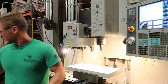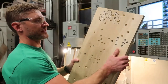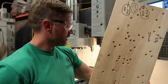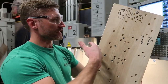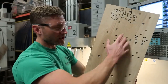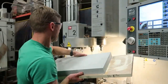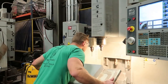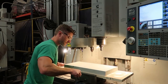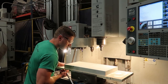On the back of this fixture board you can see I've got coordinates written down. These coordinates represent my G54, which is the part position in this machine — the machine knows where the center of all the machining coordinates are. This fixture does all three sizes of warbells: the 35, the 55, and the 75. That's why I need to write the coordinates down, because each warbell has a different position on this board. I've also got a spot marked on the fixture board with Sharpie so I know where to line it up in the vise.